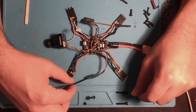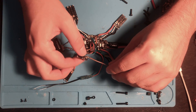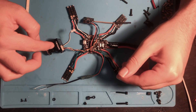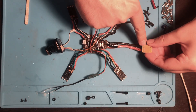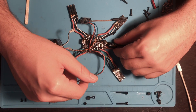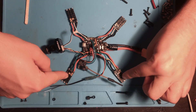I let this sit for the rest of the day. Everything looks wet but it's just coated in the Coat King and it's dry - it's not sticky really. It almost just feels like it's rubberized. I got the camera done, got the VTX done, got the receiver done, I have the entire flight controller done. I put a little bit in the XT60 connection as well as the capacitor leads. I went over the board multiple times. I don't see any points where it should short out or water should get to it. So this should be good.